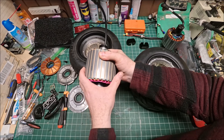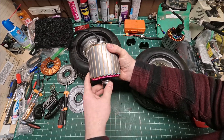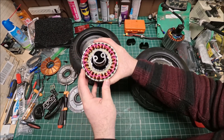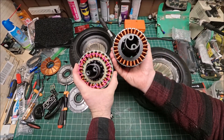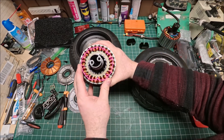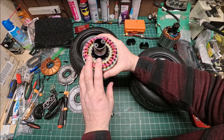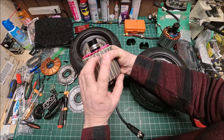Pretty much they're saying that because it's low-quantity motors, they can't really afford to use machinery — it's hand-winding. From hand-winding you have to kind of expect the windings won't look as nice and straight as, for example, a Future Motion GT winding. But in my opinion, even hand-winding should have much tighter tolerances — it should be tight, not moving side to side freely like I showed you.